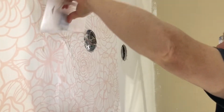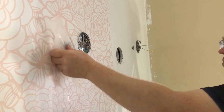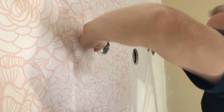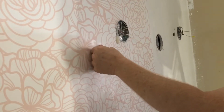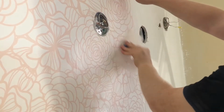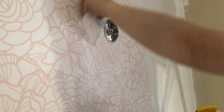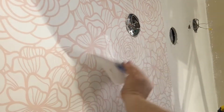Look, you just take your smoother, making sure that there are no nicks or scratches on it, and you displace the glue. That will help you move the wrinkles out of your material. And then it's just a stretching game. I don't mean literally stretching, but pulling the wrinkles out. Same thing over here. I don't know if you can see it in the video, but there was a significant buckle in it. Okay.